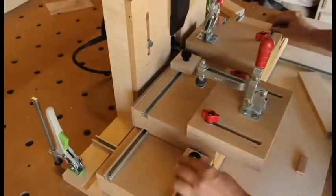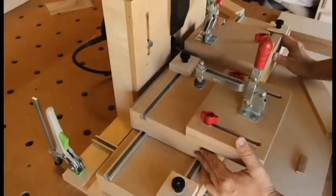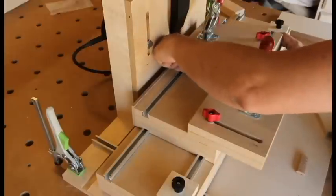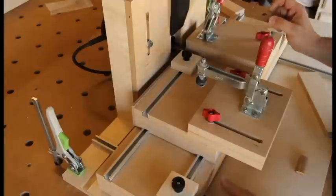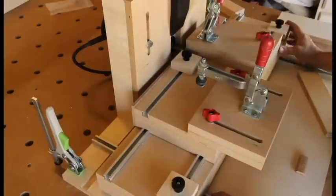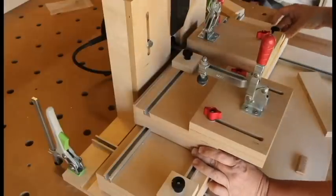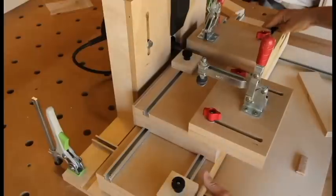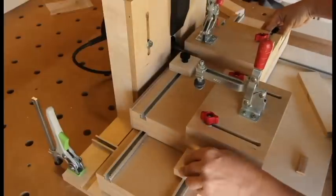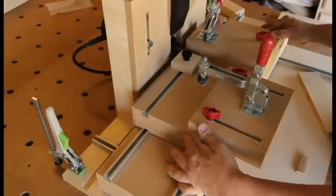So then what I can do is, if I loosen up the side-to-side motion, now this tells me what my travel of play is. I'm going to rotate the bit so the widest part is spread out. That way I can get an accurate read. Now I'm going to push it to the right, and then bringing my right side in as a stop, then I know where that needs to stop. Move it to the left, same thing, the left side, and then stop it in.